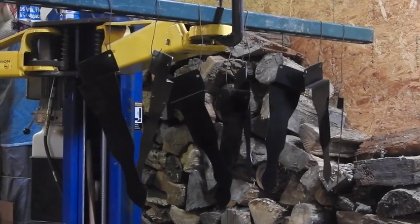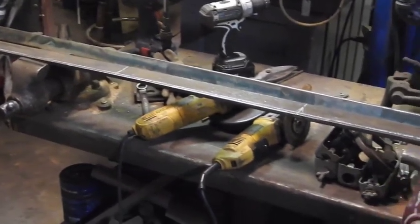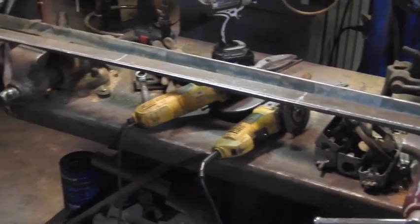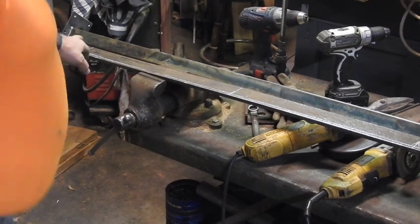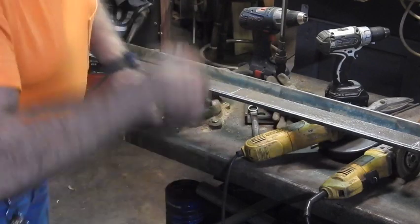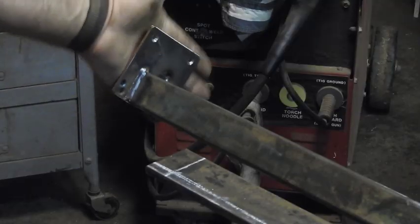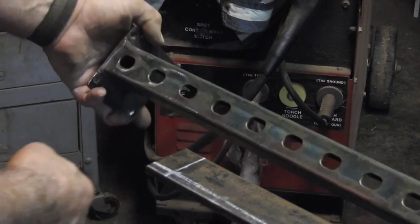I've got all the mounting hardware painted and hanging up there to dry in front of the blowers. Over here I've got about 105 inches of green Unistrut — you can see it's all buffed up so it'll go ahead and hold the paint. I'm going to paint that black, and in front of it is a piece of flat iron with the studs marked. This is going to be welded onto the Unistrut, and the bottom of it is going to be protruding up, and everywhere one of these cross marks are, it's going to be a stud where there's going to be a big long three-inch screw right into a stud. And then I've got a flange piece with a series of countersunk holes, and that's going to be screwed into the plates and into a double header that's on the backside of the wall, giving support past the opening.